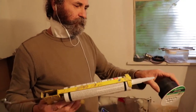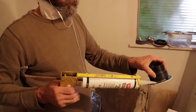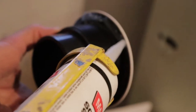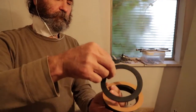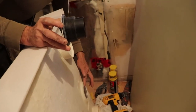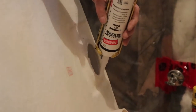You can use plumber's putty, but I'm just gonna use silicone — 100% silicone sealer. I'm gonna put a generous amount right there to make sure everything is nice and tight, because this part is very important. If you have this part sealed, the water will just go in and not go underneath. Now we're going to add the rubber and paper gasket. I'll show you behind the shower where the drain goes — not always straight, so just to be safe I'm putting some silicone down, because this looks a little rough and I don't want to redo it.